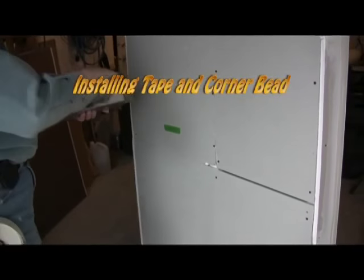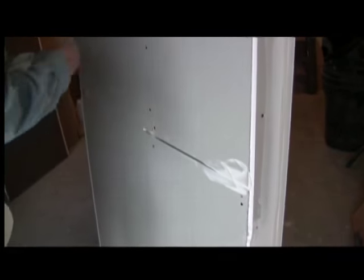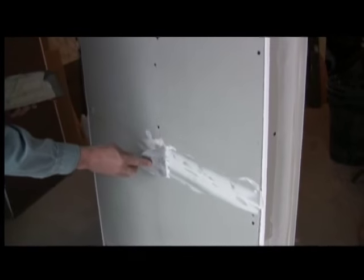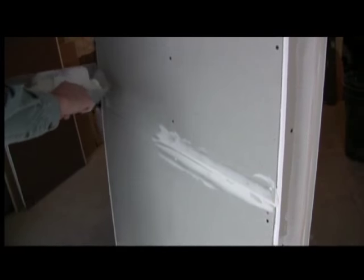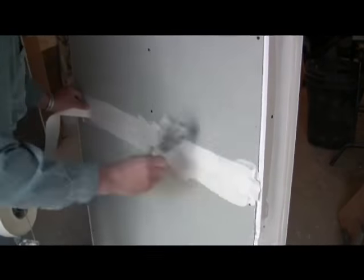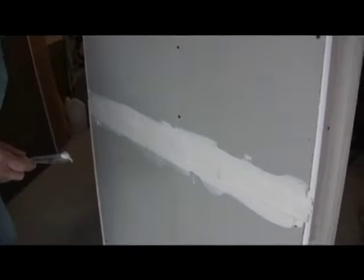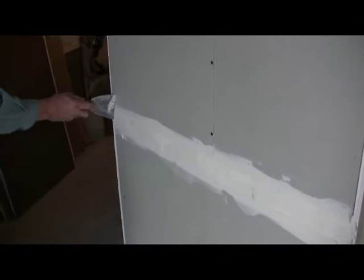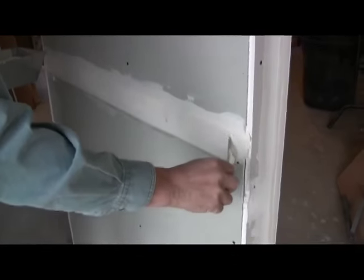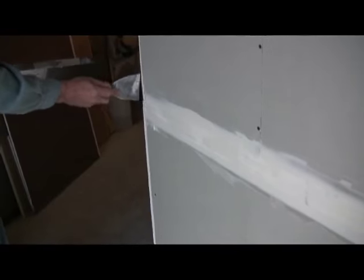Step two: installing the tape and the corner bead — regular and butt joint. If the gap between pieces is more than a quarter inch, you should fill it before beginning. Place mud on the joint at a width slightly more than the width of the tape. Make sure all surfaces where the tape will be placed are covered with an ample supply of mud. Leave no bare spots. Place the tape on the mud covering the joint, centered over the joint. Hold the tape at the very bottom and start drawing the 4-inch knife up tightly against the tape at about a 45-degree angle. The mud should run out the sides onto the knife. Don't press out all the mud — the mud is the glue that holds the tape to the drywall. Ensure there are no bumps or pockets of mud underneath the tape.